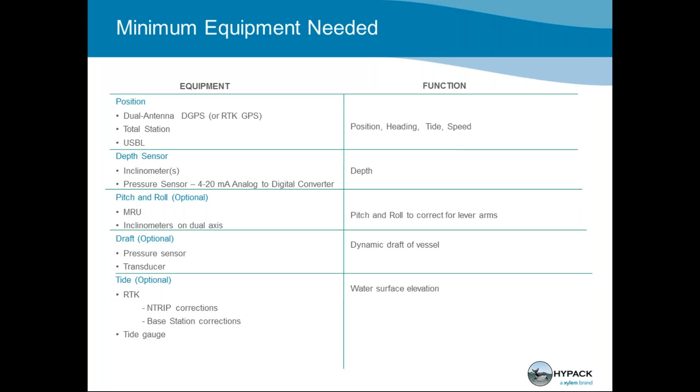Pitch and roll are optional sensors. You don't see them all that often on a cutter suction dredge. Sometimes, if the dredge is going to be pitching quite a bit — like on an auger dredge with an E-Track inclinometer — you might want pitch and roll because there is considerable pitch, especially forward and aft, as you move back and forth. With a star wheel design or other varieties without spuds holding you in place, you can have a lot of movement. More than nine times out of ten, pitch and roll sensors are not on cutter suction dredges, but they can be included.